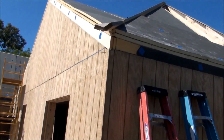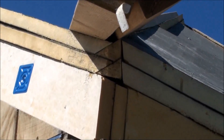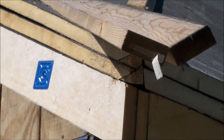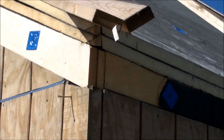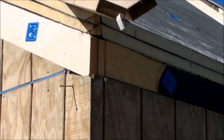What I've been doing is sort of alternate layering of almost all the roof. I put one layer down in one area and then use the next layer and try to offset the seams so that we could have as little airflow through potential cracks in the insulation as possible.